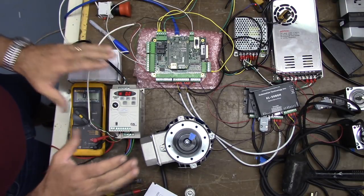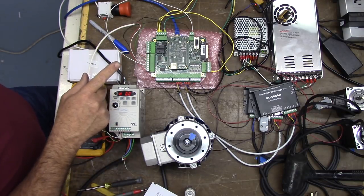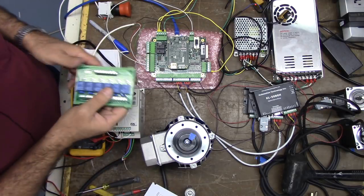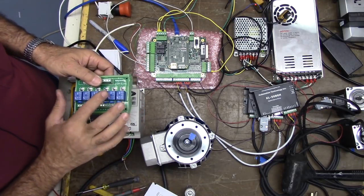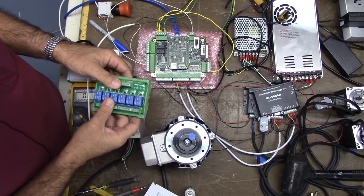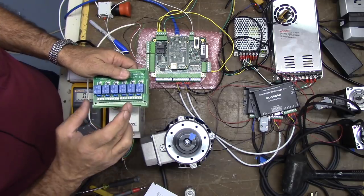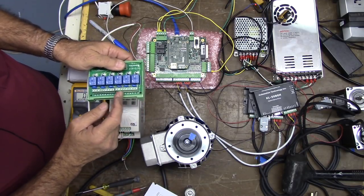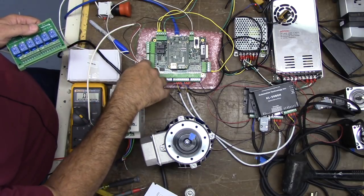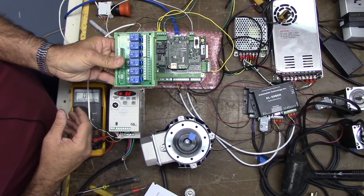This video is about the GS1 from AutomationDirect. There are VFDs that supply 24 volts, and if you take the 24 volts to these open collector outputs, you can short the ACORN board. I recommend using an NPN relay board. 24 volts goes to common and to the coils of these relays, and the inputs go to the ACORN outputs — so ACORN is driving dry contact relays, and you connect the normally open contacts to your VFD input terminals. The AutomationDirect uses a common system and is not supplying 24 volts, but in all cases you should use a dry contact relay board.